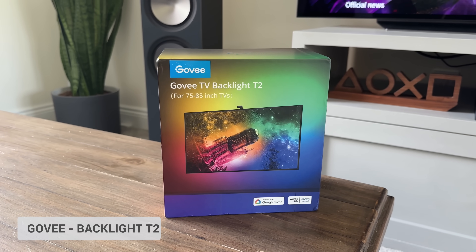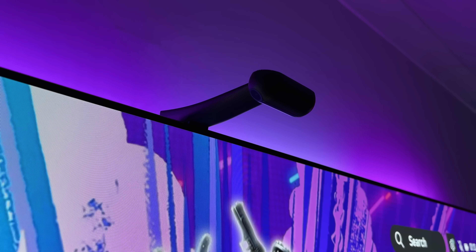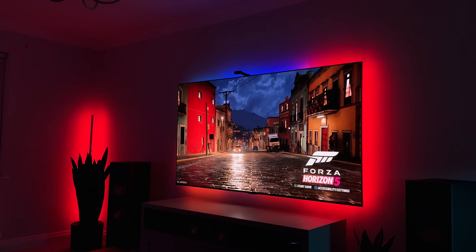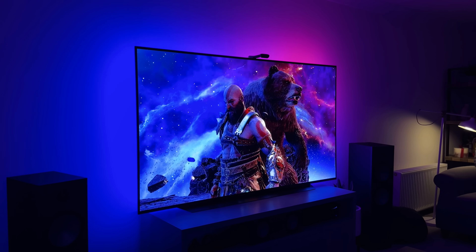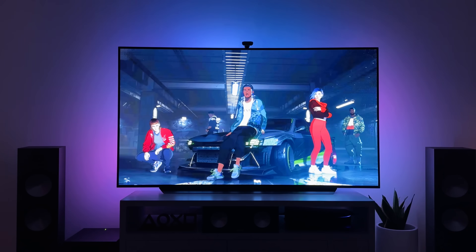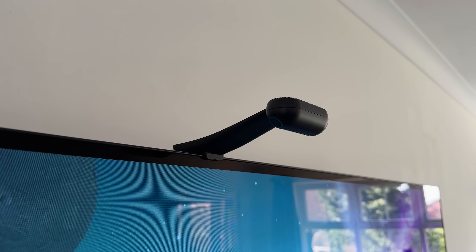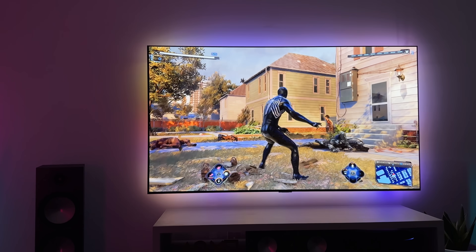There is another option — something I've used for the last few months — and that's the Backlight T2 kit. This kit also comes with a strip of LEDs that you stick to the back of your TV, but instead of using an HDMI box, it uses a camera that you put on top of your TV. This captures the image on screen without needing to use an HDMI input. There are pros and cons: the pro of the T2 kit is it doesn't restrict the HDMI input, so my TV gets full 4K and 120Hz while gaming, and I can use it with apps on the TV. But the single downside is you will have a camera on show — it's pretty nice looking and works well, but it's not as clean as using the HDMI box. Either way, the results from both TV options are really impressive and completely transform the gaming or movie experience.